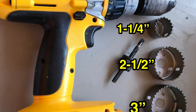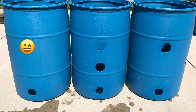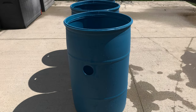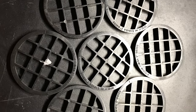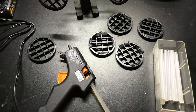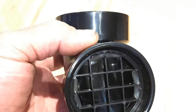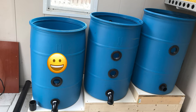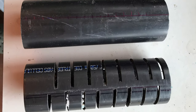Here's the drill and hole saw for the uniseal. I made a little boo-boo there, but this is the barrel drilled down. These are 2-inch vent pipe screens I'm using for my drain strainers. I'm using some hot glue to fill up some big gaps to stop the media from falling through, and I attached a 2-inch elbow for the bottom drain.